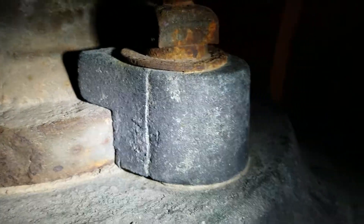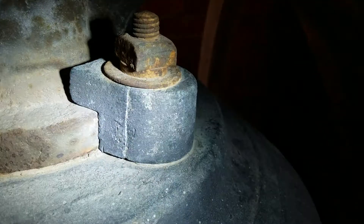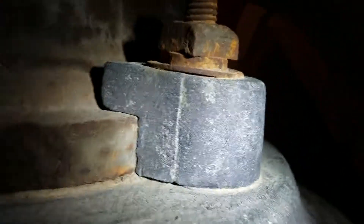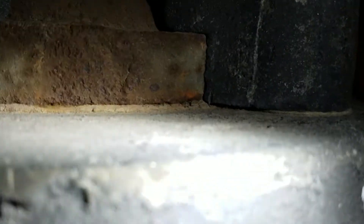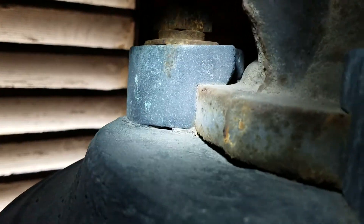Overall, these clamps — this part right here is the clamp — look pretty tight to the bell. Many times clamps are actually angled, but this one does not look angled at all. There's also a gasket right there in between the yoke and the bell; many times that will dry rot away and that allows the bell to get loose. These clamps look nice and snug against that rounded area of the yoke, which is the way they should be.